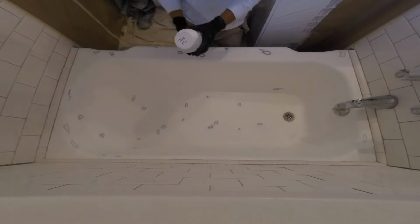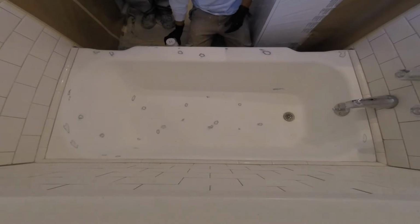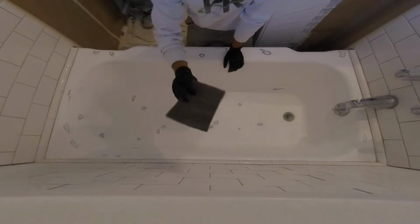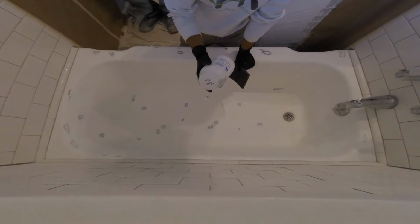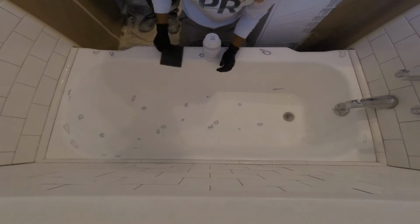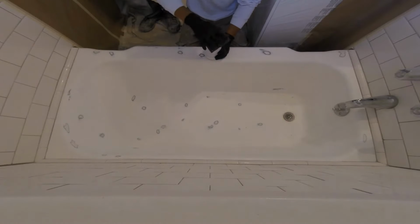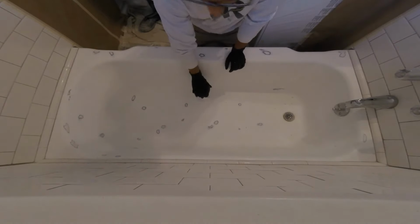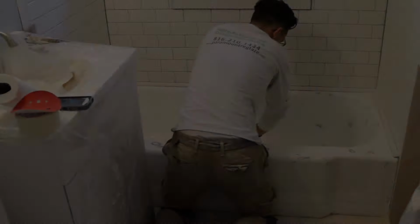Santiago. This is Wagner. Just your cleaner. Pad. Anything that's scratchy. Clean it real good. Oh, this is also good for dirty tubs. This will help us clean the cleaning process faster. It's not needed sometimes, but most of the times it is, since it penetrates through the ceramic or fiberglass. So the paint, the primer will actually stick.